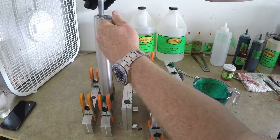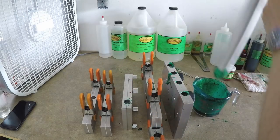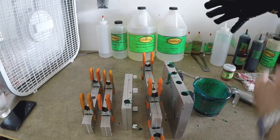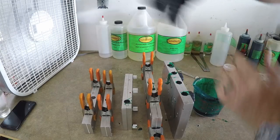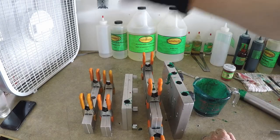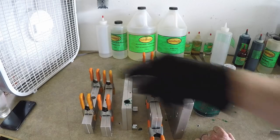The larger companies — Berkeley, Zoom, Gambler — have huge injection machines with molds that have two ports, one on each end of the bait, and they actually shoot both color streams in together using two-color injection molds. I can get those made for hand injection and shoot the back and front separately, but they're really expensive, so I just do it this way.